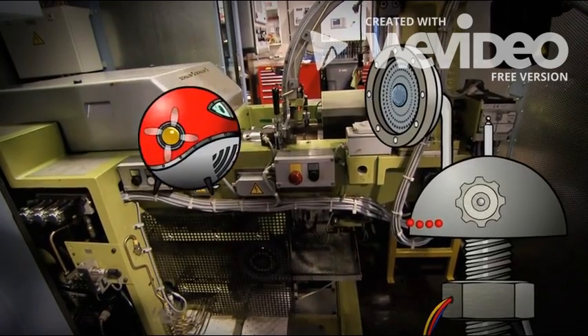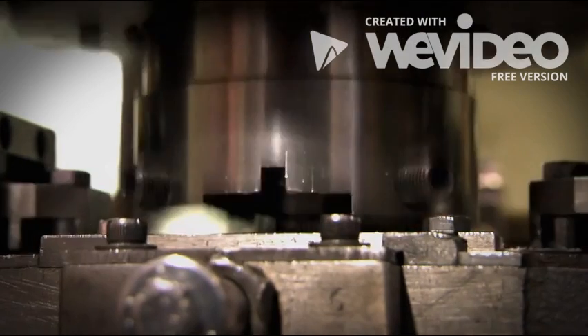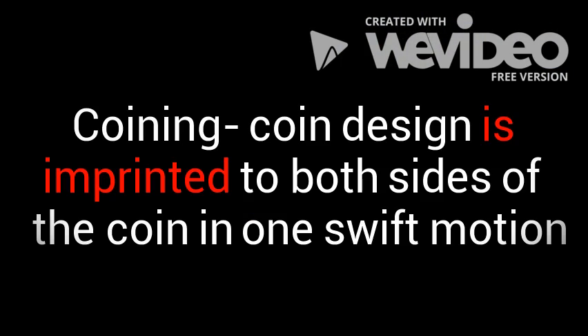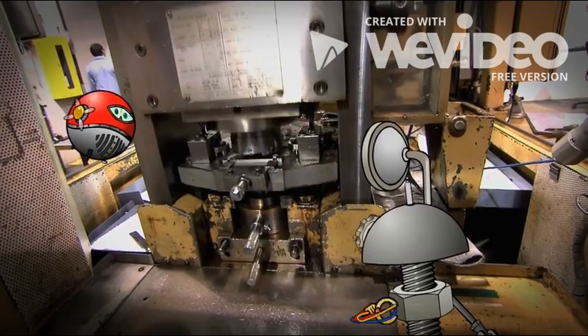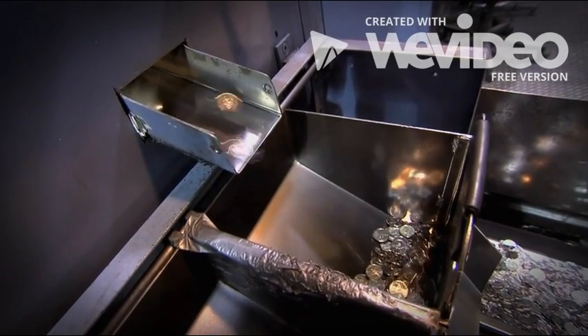These big machines are stamping the coins, but they're working so fast I can't see what they're doing. The final step in this process is called coining. This is where the coin design is imprinted on both sides of the coin in one swift motion using the coining machine. After these coins are produced, they are carefully inspected by an inspector who gives the clear for distribution around Canada. It is money now — a perfect coin every time!